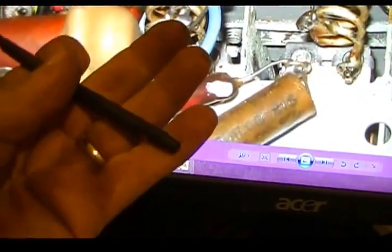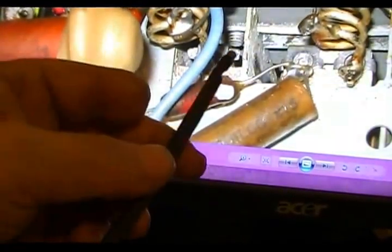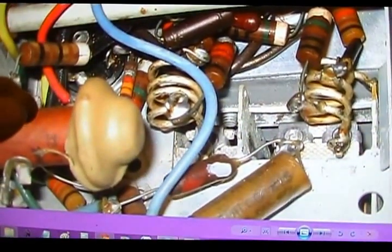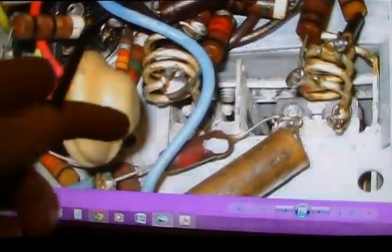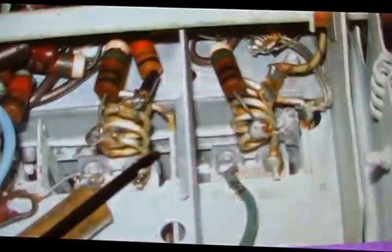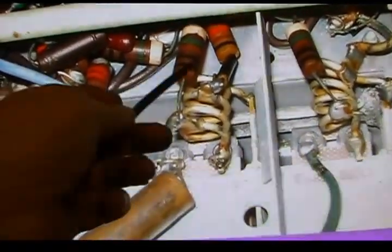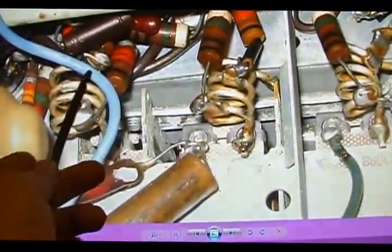Like I say, it'd be in the instructions when a person does alignment. And when you do that, you want to do it just ever so slightly. You don't want to move it a lot, just a little bit, and then try it again, a little bit, and try it again. The thing is, these very seldom ever will give you any troubles. They should not ever be out. These are not resistors, these are caps. They're ceramic caps that are hooked in there.